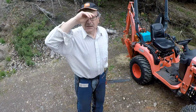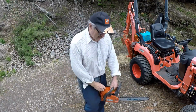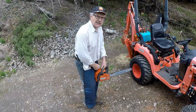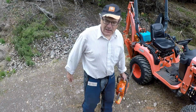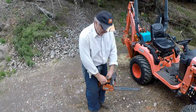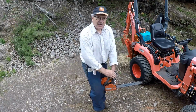One of the other things you may notice when I'm using the chainsaw, when I start it, I lock the handle between my legs, between my knees, like this. It's something I learned on YouTube. I think it's the Husqvarna channel. It has some tutorials. What that does is lock the saw into place, by putting one foot over the handle. When you pull it, it doesn't come up. Plus your hand is here to pick up the bar.